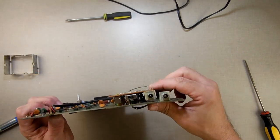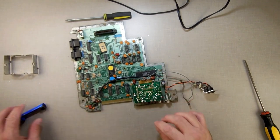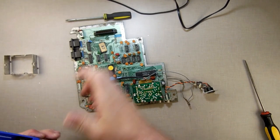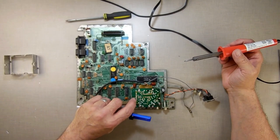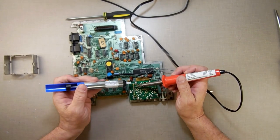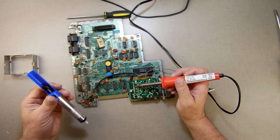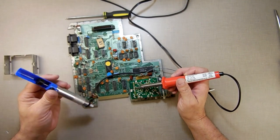Can's off! Now what you have is a PCB board attached by a little plastic connector with solder and these two clips — this is actually pretty easy to get out, using the solder sucker or wick. The only place the RF modulator PCB connects to the main board is this little string of eight connections. So you just heat them up, clean up the carbon. Heat the pin up, suck out the solder — play the iron against the pin, suck out the solder. These are coming up very easily. Just go down the whole line, all eight of them.